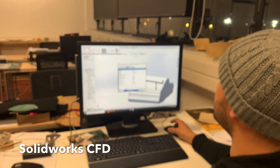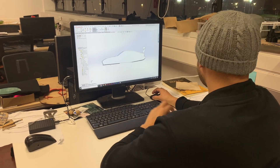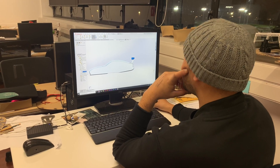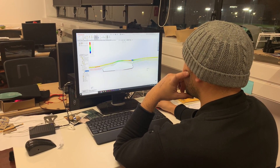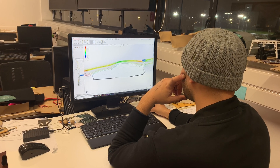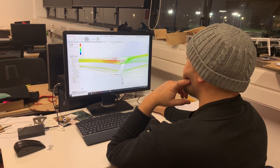So it was finished. For the wing, I got the shape of the 180SX and we basically set the wing on there. This is just to see the drag and the negative lift it'll produce. So this shows what it's actually doing — the boundary layer through there, the low pressure, and the other section in here which is where it starts separating. And there's another boundary layer through there. If I make that transparent you can see what the wing is doing and the different pressures.